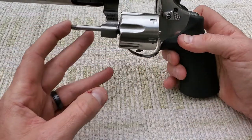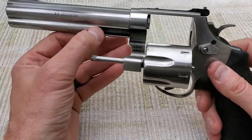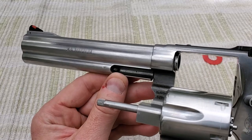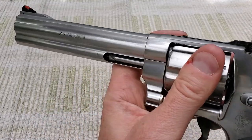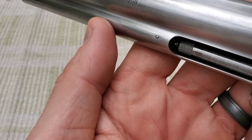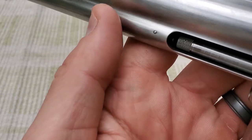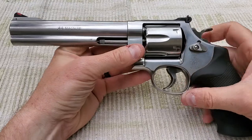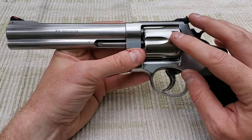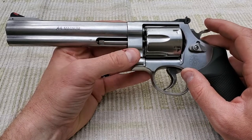All that does is push your cylinder rod ahead. This thing is all spring loaded all the way out to the tip here. It moves that, and then inside the lug — in the under-barrel — there is a detent. If I push that button, you can see I'm pushing the button, I'm on the detent, and then you release it by pushing that detent in. So if you've got a stuck cylinder and can't get it out, I would lube the crap out of this cylinder rod.